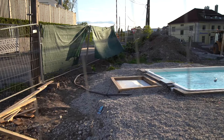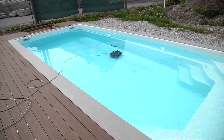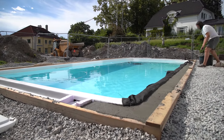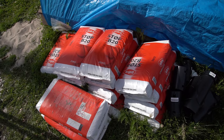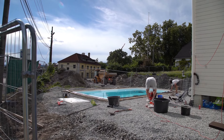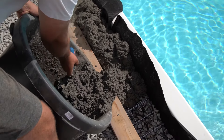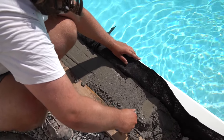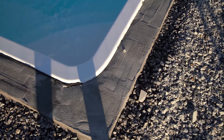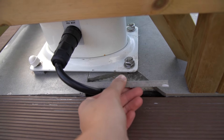Step seven: time to figure out how the pool goes with everything else in your yard. We went for a frame of tiles surrounded by composite decking. We started by building a formwork for the tiles, then cast the concrete around the edges using the same B20 concrete mixed with water — this was by far the most exhausting job due to the heavy mixing. Once stirred, we applied the concrete within the formwork leaving room for the cement at the top, leveled it out, and kept watering it as it dried. We let it solidify for about a week. It is common practice to wait a year before attaching the tiles, in case the ground moves and causes cracks.